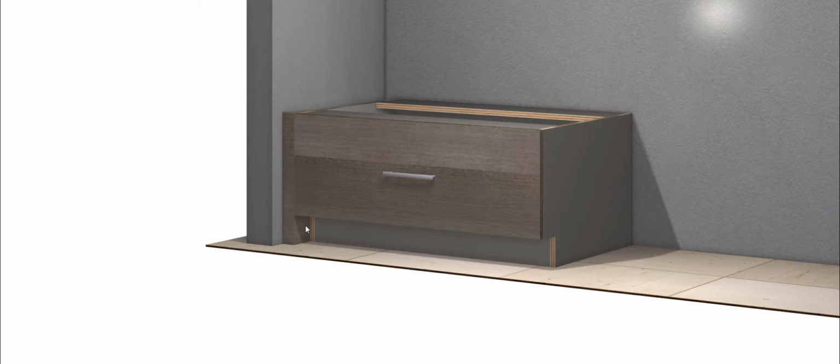So an acceptable area to use a flush toe kick is going to be, number one, a tall cabinet, very simple. Also a mudroom bench cabinet, because you're probably not going to be right there all the time. You can reach for your coat, you'd probably be okay. It also looks nice and it's more of an aesthetic choice, but you can always do a recessed toe kick if that's what you want, if you like that look.